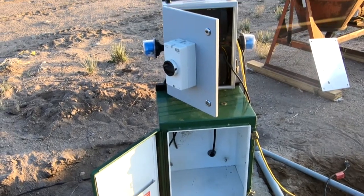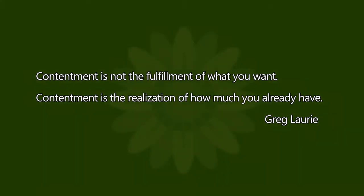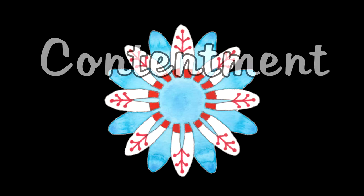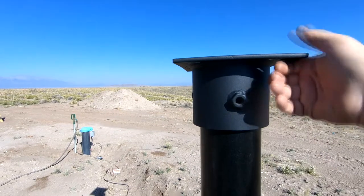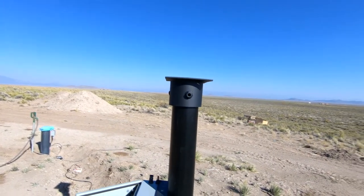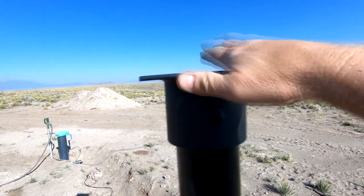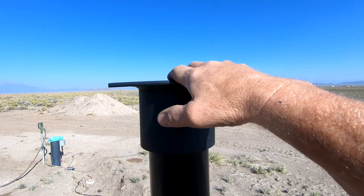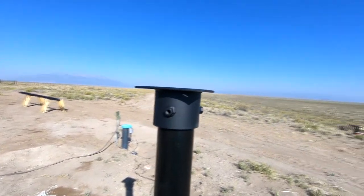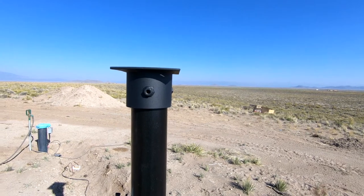This is part two of our off-grid solar well and Wi-Fi station. This is the mounting bracket for the solar panels, and it's about as tall as my eyes. There will be a post, sitting over there on the sawhorse, that will rest in two saddle-like U-bolt frames and then stretch across like this. That pipe is 15 feet — enough to accommodate four large solar panels. This system is called a Sunrack, provided by a company called Genpro.